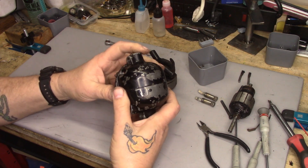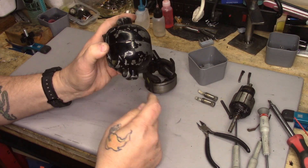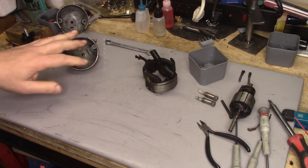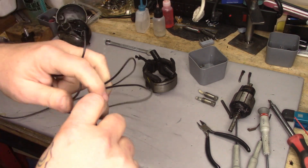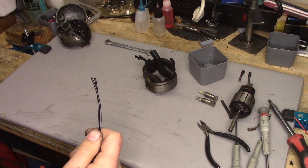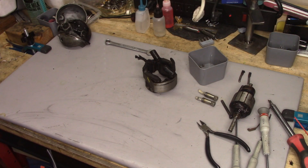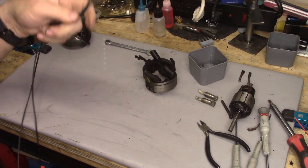That can be easily done at a later date. More importantly, is getting this motor finished. I'm going to put these cleaned and dried pieces aside — we're not going to need them for a while. I did cut a lot more 18 gauge wire than I'm going to need. I am using Stinger Select SSPW18BK, my favorite motor rewiring wire for these little motors.